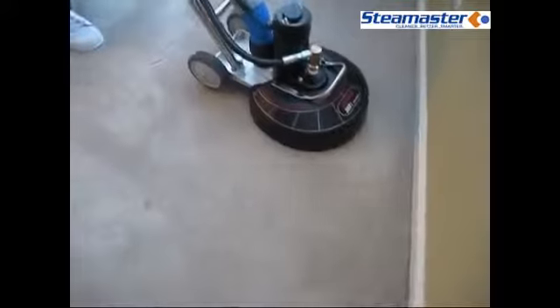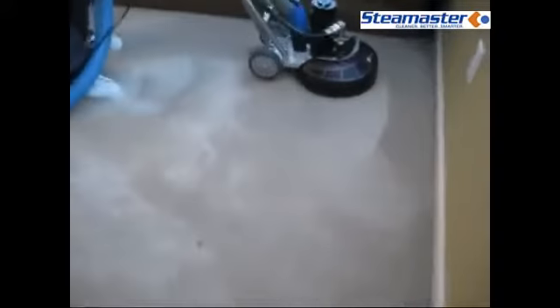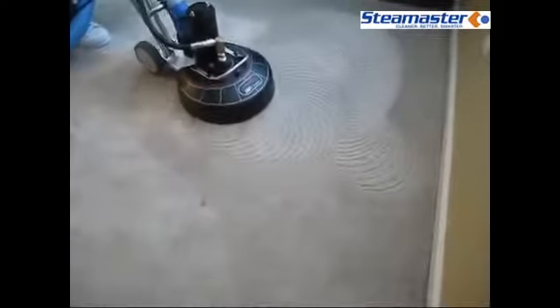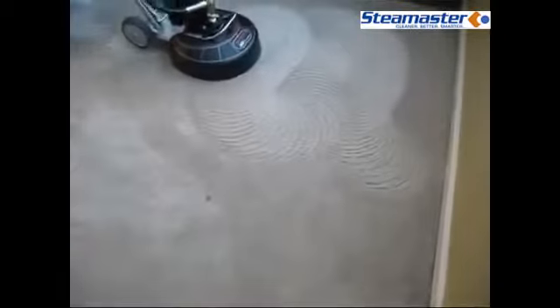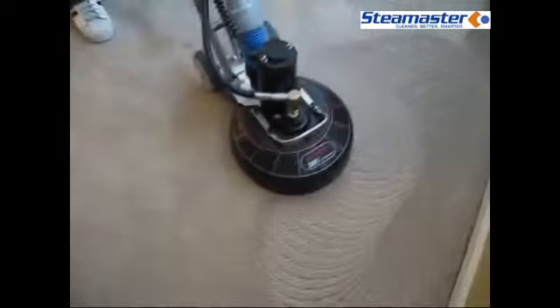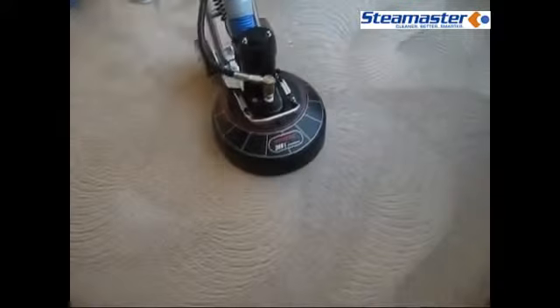One good thing about the 360i — where a lot of guys bring in a scrubbing machine with brushes — I would never use a brush on a carpet unless I'm spot cleaning, and even then it would be a very fine brush. You don't want the carpet to start fraying, or what some people call blooming of the carpet fibers. Since the Rotovac 360i has no brushes underneath it, it causes no damage. Just don't leave it in one spot because of friction — that would apply to any machine. I've had nothing but great results. It's super easy to use, very versatile, and it's quiet — it doesn't bother the customers.